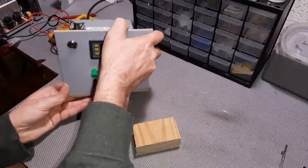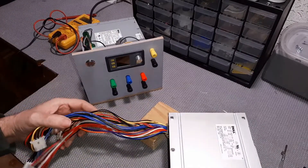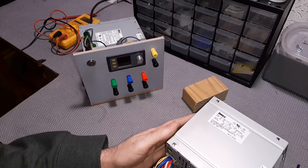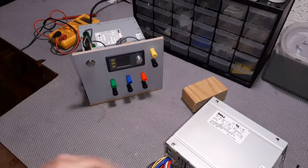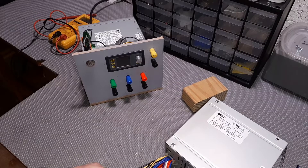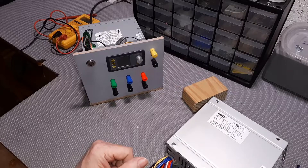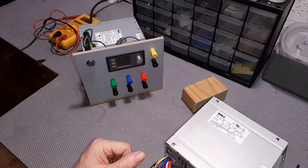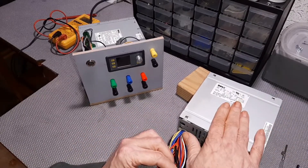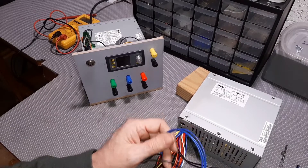It's extremely simple - the wiring took about 10 minutes. If you have any old PCs laying around, go ahead and make yourself a power supply; they're easy and there's no sense throwing away a perfectly good PC with usable parts. They're also available online. As for this other power supply here, I'm probably going to use it to supply 3.3 volts for driving the lighting on my layout. These three terminals will give me 8 amps to power all the lighting on the layout, which should be more than enough.